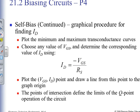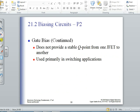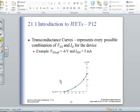Transconductance. So, obviously, somebody got their Greek involved in this, right? That is a transconductance curve. It says so right there. How come I didn't say it before? So that's my transconductance curve. That's the minimum. That'd be the maximum transconductance curve. I've got a minimum transconductance curve to put in, and then I've got some load line that's going to go in, and I'm going to be on the load line. So that's my plan. I'm sticking to it.